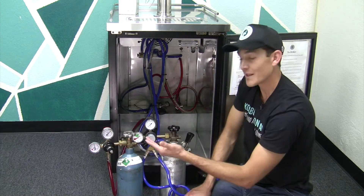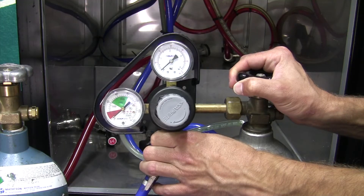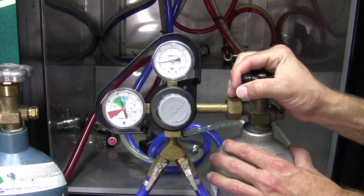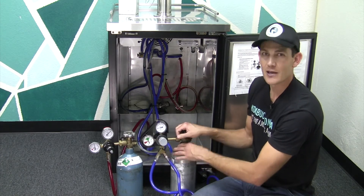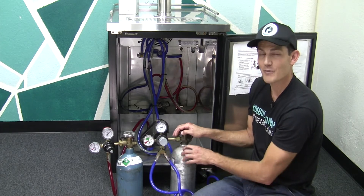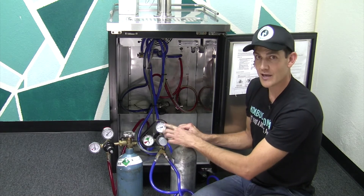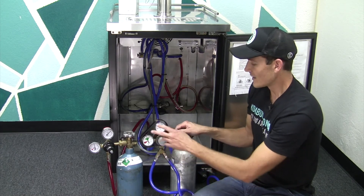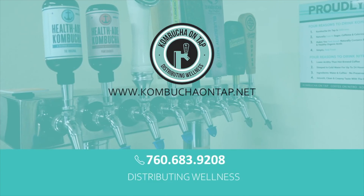Let's go back to the CO2 cylinder. Right now it's still at zero because we haven't opened the tank yet. Go through and open it up just gently to get the gauges to rise, then open the tank all the way. That just makes sure you're not overwhelming the gauges by allowing all that tank pressure to rush in — give it a little bit to set the gauges properly, then open the tank all the way. It allows the equipment to last a lot longer. This shows the tank is about 800 psi — this is a five-pound CO2 tank, so 800 psi represents a full tank. The line pressure is set properly, and once again you do not need to change the line pressure between cylinder swaps; that's preset. Now this is all set and ready to go — you'll have your kegs connected and ready to pour. Thank you.